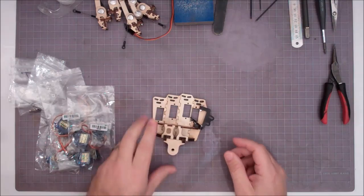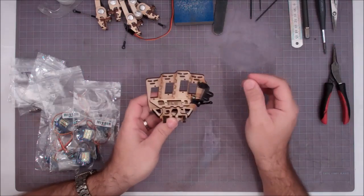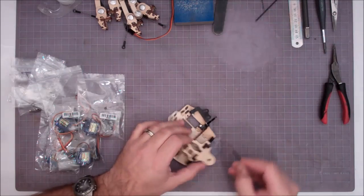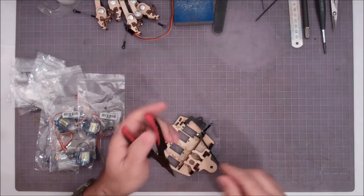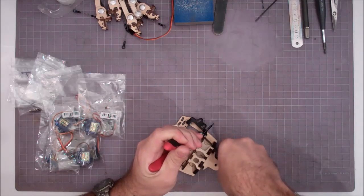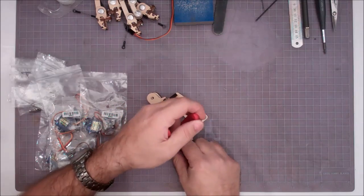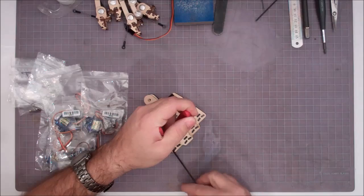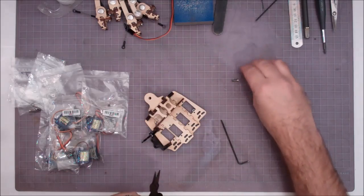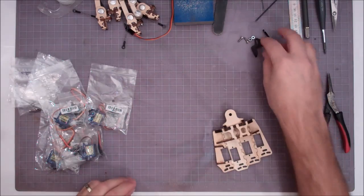and go from there. In looking at the assembly, I decided that it'll probably be easier to put in the servos with the thumb wishbone out. So first thing we're going to want to do is go ahead and remove that. I know I had you put it in the last assembly, but thinking about it, I think it'd be better to leave it off so we have room, because these little screws that hold in the servos can be kind of a bear. So we're just going to start by taking that off. Just those 2 screws, set them aside. Set those aside, and the wishbone goes over there.